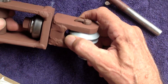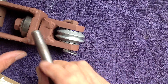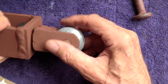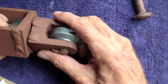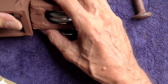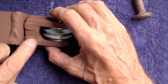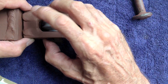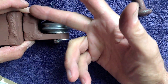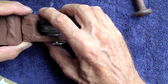This is probably gonna be the only M16 by 2.0 thread I ever tap. I tapped it into this piece here — which is actually a piece of three-quarter stock. It wasn't a three-quarter by two, but I cut it down with my welding grinder to about three-quarter by inch and a quarter. So now it's welded on all four sides. When I welded in the nut earlier, I only welded it on four sides because the nut is six-sided, and I couldn't weld it in there because it was too close to the threads.